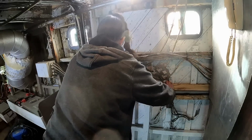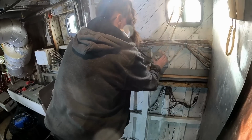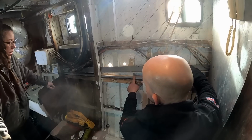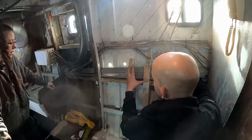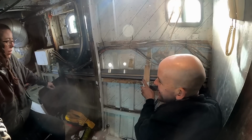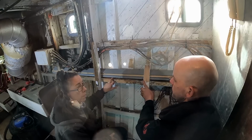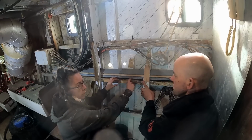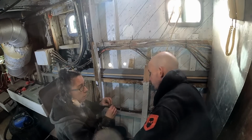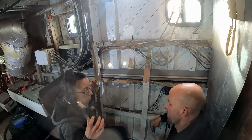Okay, hold on. To do now is epoxy this, turn that onto it, drop that down, epoxy the other one, drop that down, then clamp it all up and then glue it to this and then put some bolts through it. Okay, so question. Should we get it sealed now? Sealed with? Glue. Okay, yeah. Push the bottom one down. Screw the bottom one to there, because then it'll get a nice fixing, and then epoxy it, do the next one, epoxy it, do the next one, because then you know the bottom one's got a good fixing.